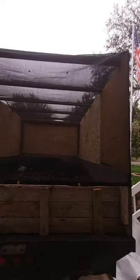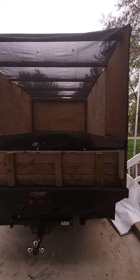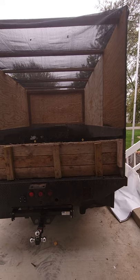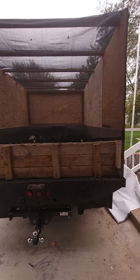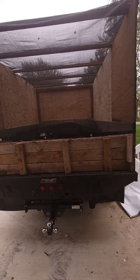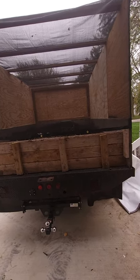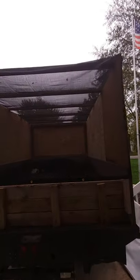The boards I'm going to slide in there will be cut to fit — they need to be seven feet wide like the bed is. If you take a four-by-eight sheet and cut one foot off one side, you get seven feet, but it'll be four feet deep, so you need three of those to make 12 feet. This is an 11-foot deep box, so cut one foot off the final board and you can just run in three slats — slide, slide, slide.